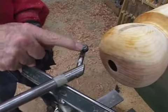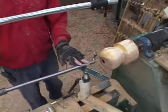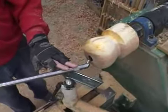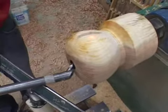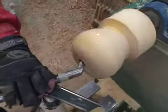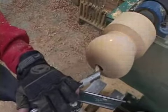Now, this shape here mimics the old Stewart hook system and the John Jordan type tools. Okay, so we can thread it in the hole now and get way up underneath and undercut a shoulder, way up under, and starting to cut right now in the shape that was in there is already there. So now we can go up in there, we can cut up under the shoulder, and we can reach way around and keep just going deeper and deeper and thread it into the hole.